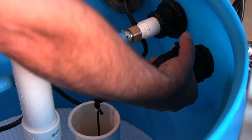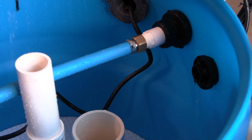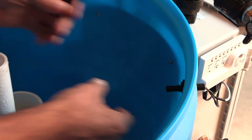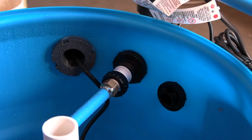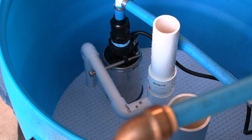You need to disconnect the inside by taking the differential fill valve off, taking the electric level switch off, and disconnecting the union to the pump, and take the lock off the pin and the pin out, and then pull the pump out.